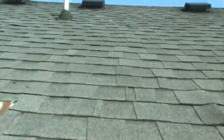Out here in the gutter, this is what I'm talking about with this grid. And this is just a small section of run on a not very big section of roof. And you see what happens here. And then you've got the downspout is clogging here, so the water's backing up this way, and the water's getting into the house in this corner as well.